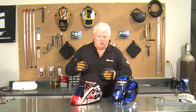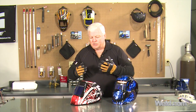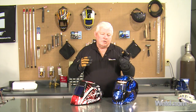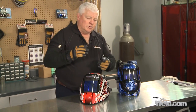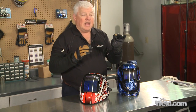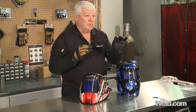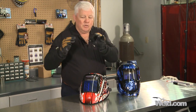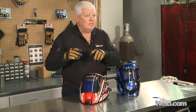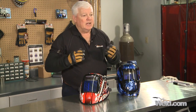Inside this helmet, you have to make this adjustment. It does have a chip in it. If you want to do real thin material and need to upslope to heavy material, you can make this helmet adjust to that. For instance, I can go inside the helmet and set it to 5 — if I'm micro welding at half an amp, it'll show me a shade 5. And if I jump over and I'm welding at 200 amps, I'm going to want a 12, so I can program that into the helmet itself.